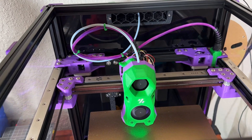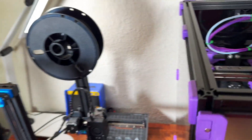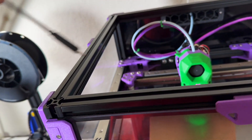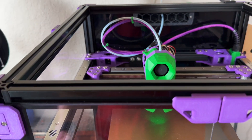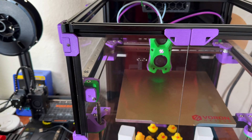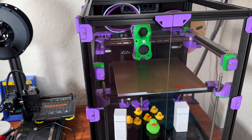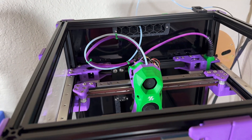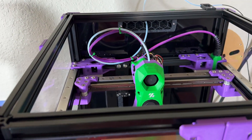I have flashed the board. It wasn't actually super difficult. You plug in a USB-C cable, put a jumper bridge on the board to enable power via USB, compile the firmware from Raspberry Pi, and follow the instruction. The instruction is amazing — it has all the pins pinned out and explains how to build the firmware. I'm very impressed with the documentation.